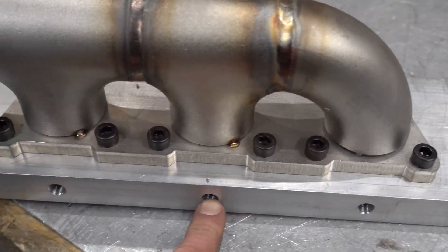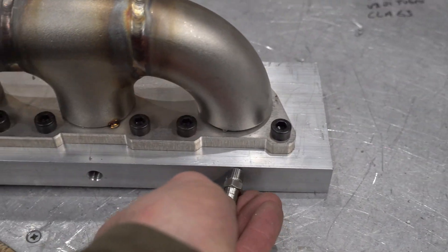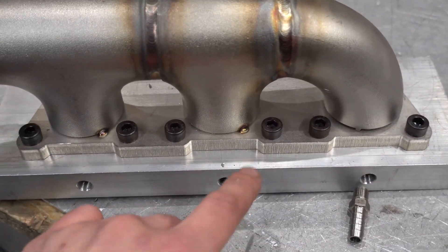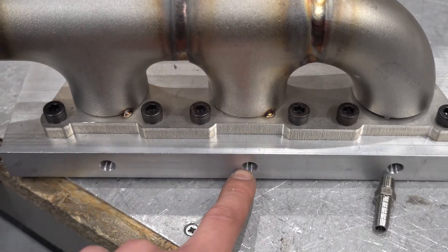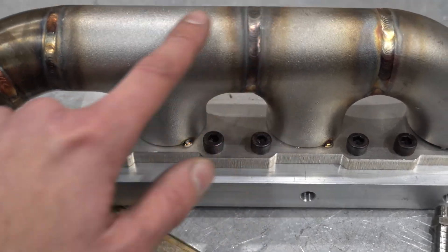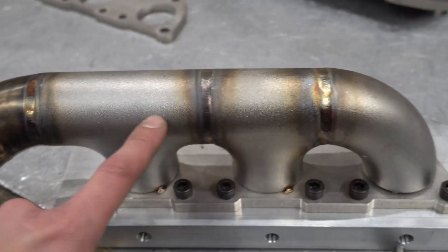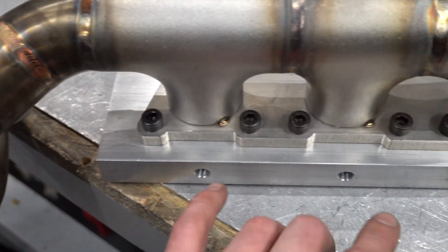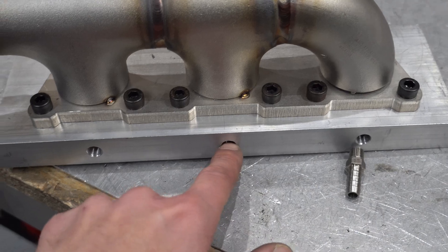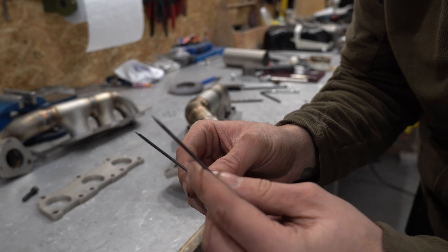That's the chill block all done and bolted down. I just need to put the purge line barb in each row. I'll cap the runner openings off with a bit of tinfoil. Argon is heavier than air, so I don't want it passing out of the bottom — I want it to continue up and out, pushing the oxygen out. Block them slightly so it takes the path up and out, but let a little bit drain so you know it's flowing.